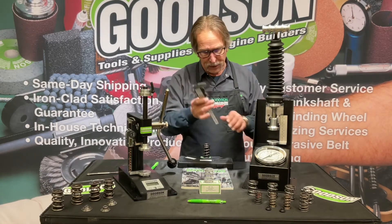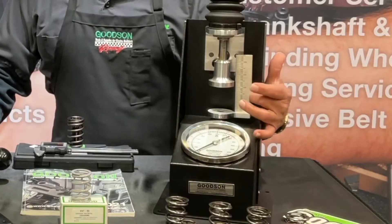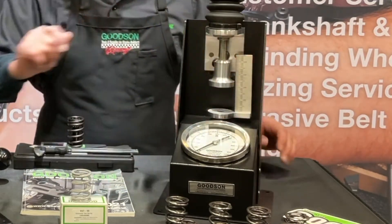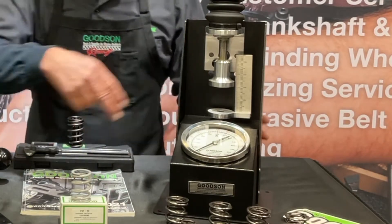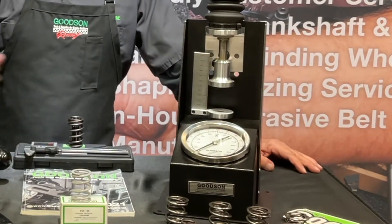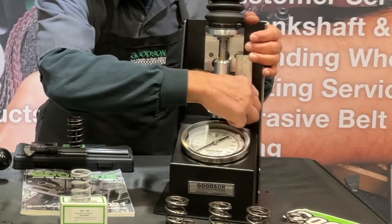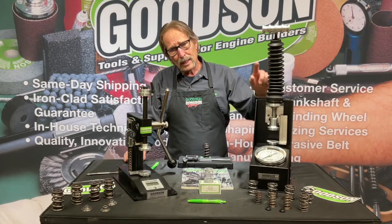I always like to keep my calipers handy, because with this analog machine we've also got an analog dial reading in thousandths of an inch. So you can set it to, say, 1.600, 1.700, or whatever the spec requires — it'll be written on the scale, but you confirm that with your dial calipers. One thing I really like about this one is it also reads metric, so on this side I can do a quick flip and work in metric dimensions of those same heights.